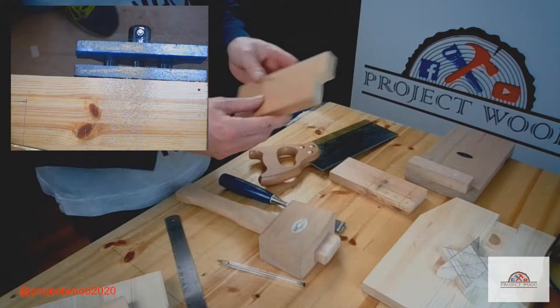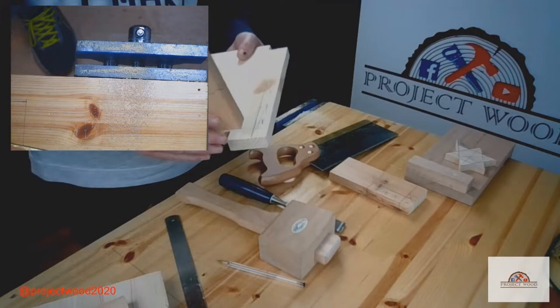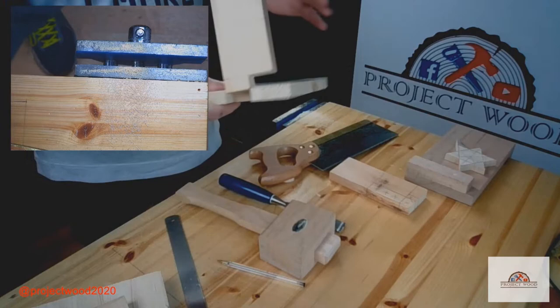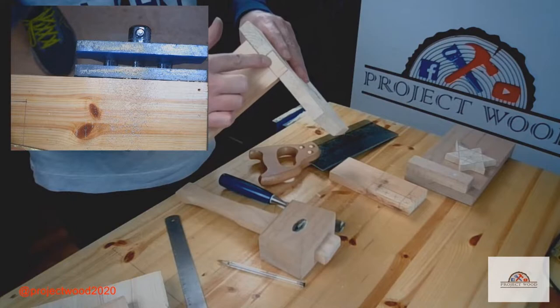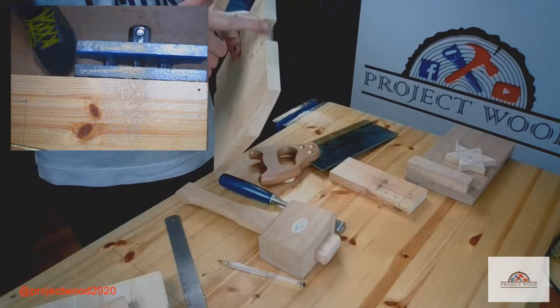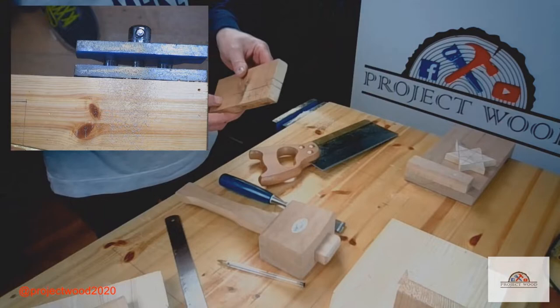So that one, if you remember, is slotting just into the back left corner here. Actually no, this is for the right hand one. So it's a good fit straight out of the box there. And if it's too loose, you can always put a screw in here. And if too tight, just pare some material off the cheeks of the female. Leave that in there for a moment, so it gives us a view of where we're going. Now the next piece has a few extra cuts, so we'll take off this corner first.